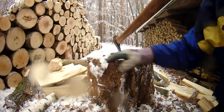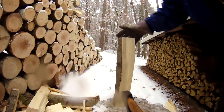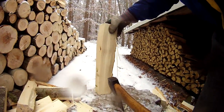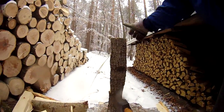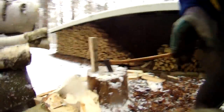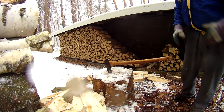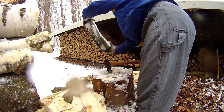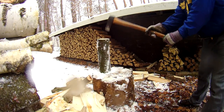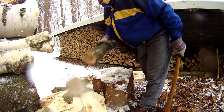I use it on a slight slant. Naturally you can turn the pieces when they don't stand — even small pieces don't always stand. If it's not perfectly perpendicular cut, this way they stand then, so it's good to have it on a slight slope. And as you can see, I'm working way back on the block — if the axe goes through, you still hit the block and you don't hit the air where the axe could come flying back at you. See, the axe sticks in the block, and you're safe.